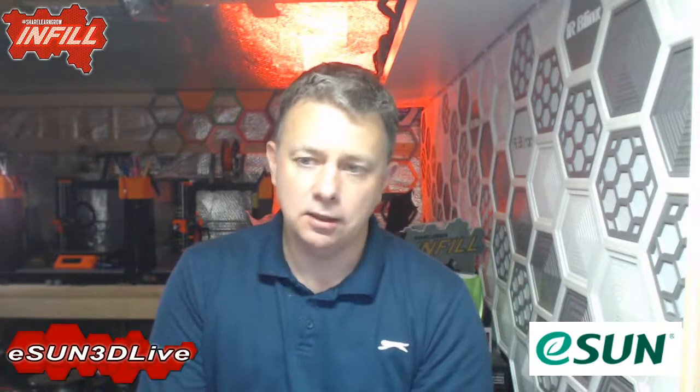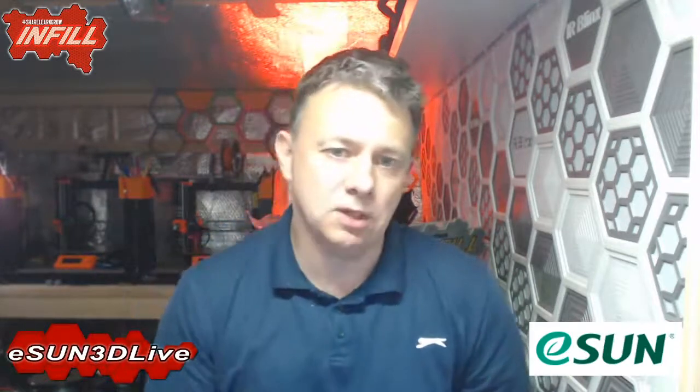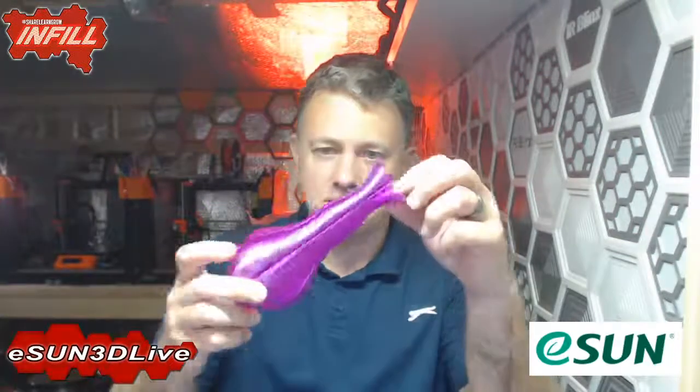I tend to turn off retraction completely, certainly on the Mark II, where you've not got that nice constrained filament path. So you get better stringiness, yes, but when you're doing things like vase mode, you can see it doesn't have to come away at any point. It's just a continuous run all the way at the top, and the finish is great. So absolutely no issues with that.